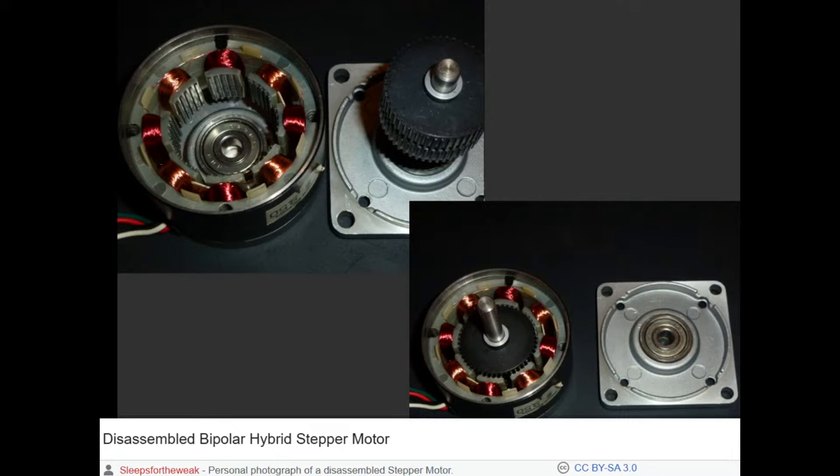So the other alternative is the other motor that I showed, a stepper motor, and a stepper motor doesn't have brushes. It's a brushless design, because instead it has four or some multiple of four windings, and there's a magnetic toothy axle and a toothy outer ring, and as each phase of the motor activates, those teeth move the motor forward by 1 degree or 1.8 degrees at a time. The thing about stepper motors is they're not very fast, but they do have precise motor control, and they can stay still.